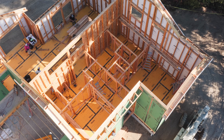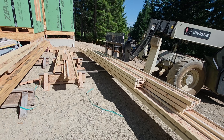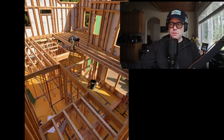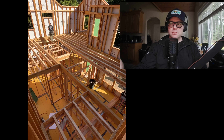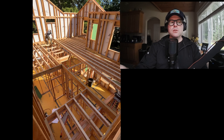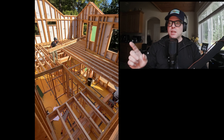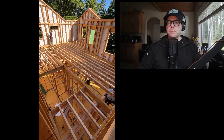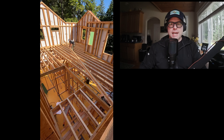There are all of the I-joists — the second floor is cut. Because we ordered these continuous, there is less material to handle. You also get a stiffer floor system when they're continuous joists over multi-span. So it goes really fast framing the floor.